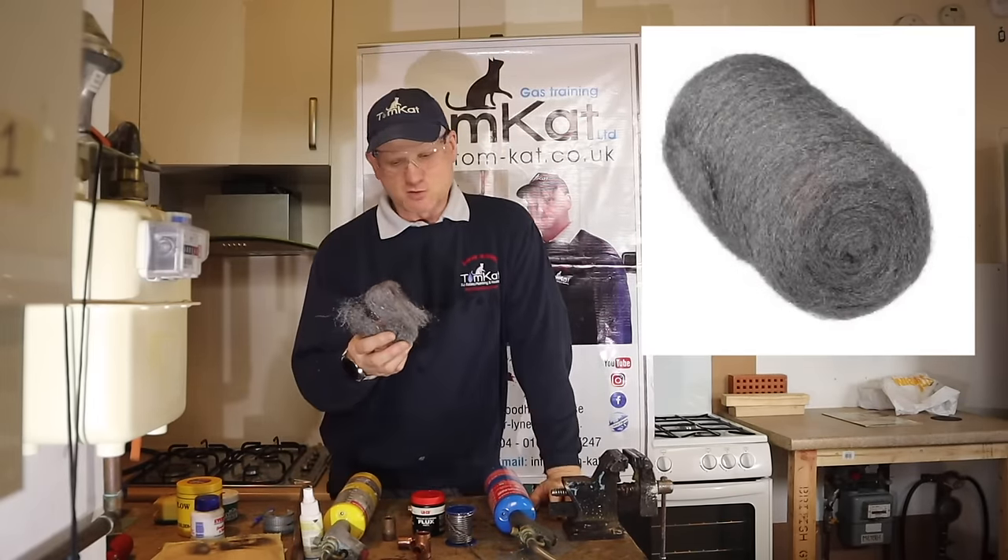I'm not going to use MAP gas — that's a bit extreme. I'm going to use the propane. Whether the blow lamp goes in your left or right hand makes no odds whatsoever. Regarding how much solder to use: the training manuals say to use the diameter of the pipe — bend the solder to the diameter of the pipe and that's how much solder you need for 22mm. You'd do the same for 15mm and 28mm.